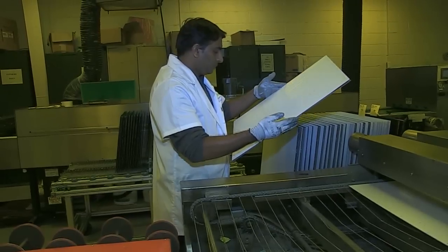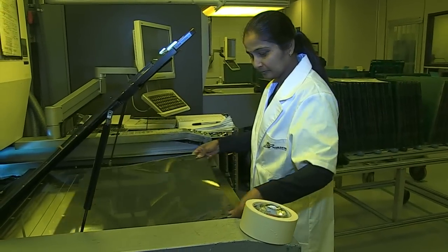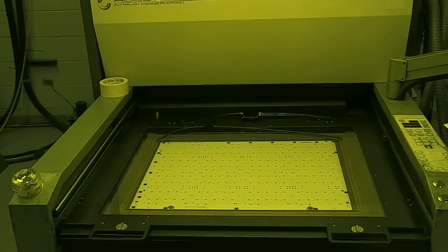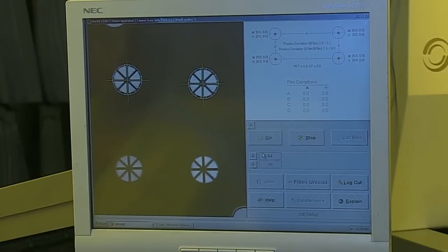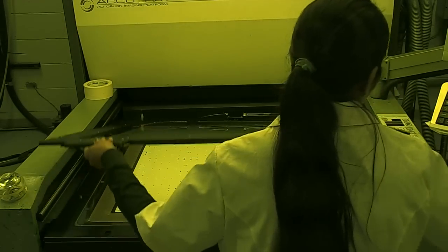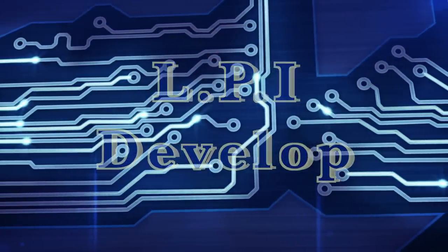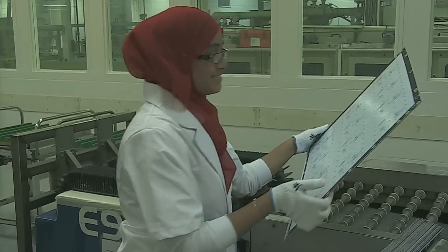The operator checks for a complete and even coating. The panels are imaged using a two-drawer UV printer. The operator mounts the photo tool films on the machine and then places the panel onto the registration pins. Mask alignment will be better than 50 microns. As with the etch and plating resist used earlier in the process, the UV lamps in the machine harden the ink where the film is clear — that is where we need solder mask on the finished board. The image panels are put onto a conveyor out of the clean room and into the developer which strips off the unhardened and unwanted resist.